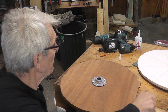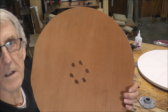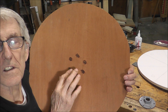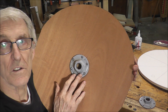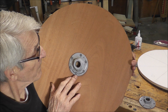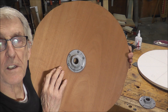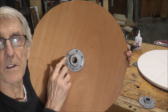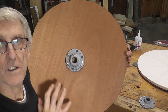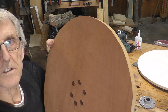Make up quite a number of them so you can dedicate one to something without worrying. Use the largest screws you can, preferably not going through the outside — in my case the little tips just barely pushed through the wood, so I took a little grinder and took the tips off. That gives a good hold with the screw through the full thickness of the wood, which is quite important. I put it on, then took it off again, put a little CA glue in the holes where I screwed it on, then screwed it on again — that locks it up tight and strengthens the material where the screw goes in.